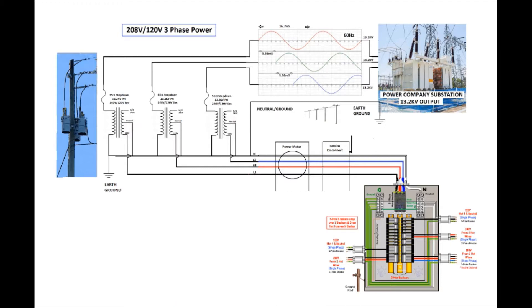I finally figured it all out. The big trick is that any one of the three wires can be L1 — it's just the two that come after it. You have a 50/50 chance of the rotation being counterclockwise or clockwise.